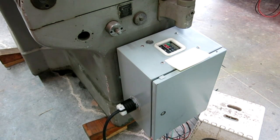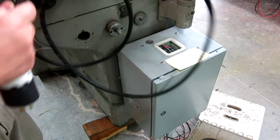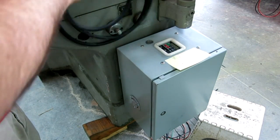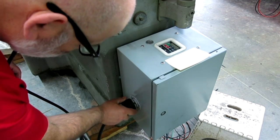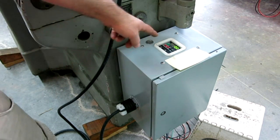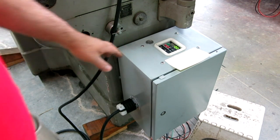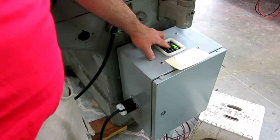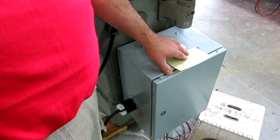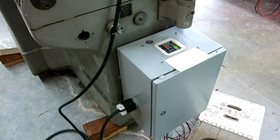The sub spindle motor — I've got a disconnect so that I can dismount it and take it off the machine and put the lathe tool post on. I'll turn the VFD on and you can see it's coming up here — it's ready to go. It's just flashing, it's ready. I have it set at about 38 hertz right now, which according to my calculations should be around 1400 RPM on the motor up here.